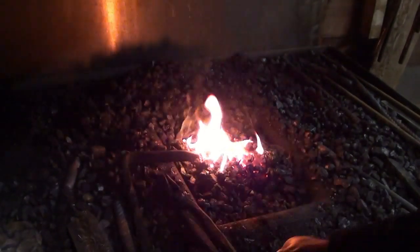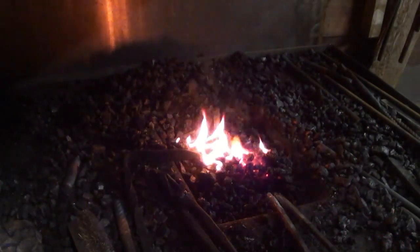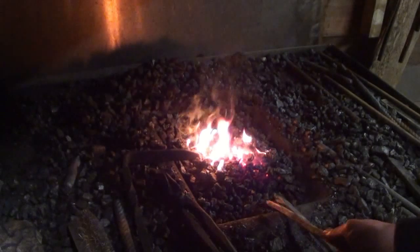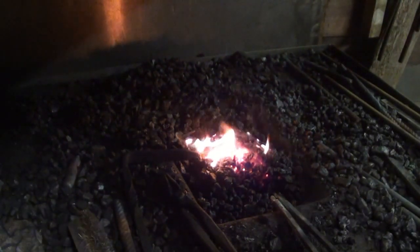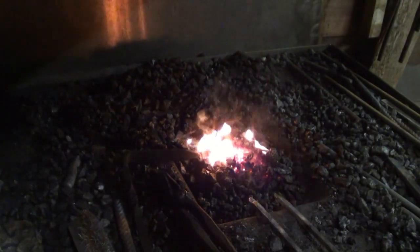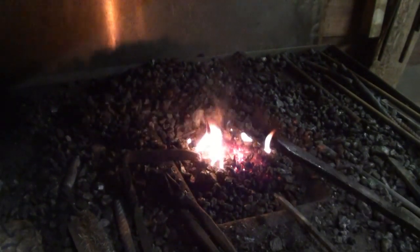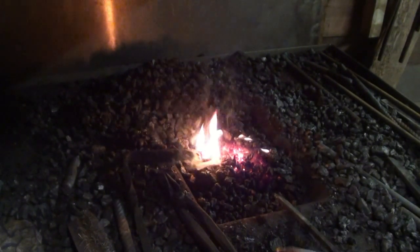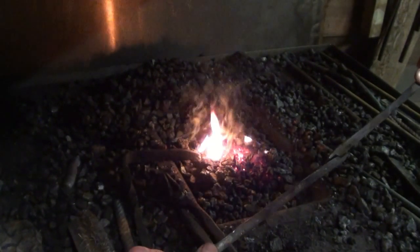Now this is how I will be going to work. Take both pieces and put them in the fire. Heat them up to around an orange heat — orange-yellowish — and then either take them out and throw on sand, or do it while they're in the fire. Look for the glaze that should be forming on them. Then put them a bit deeper so you can make sure this piece doesn't burn off because it's thinner and will heat up quicker. Make sure this is evenly and well heated so that when you put them on top of each other, it will weld.